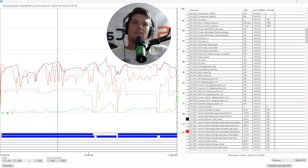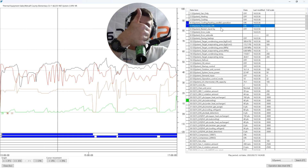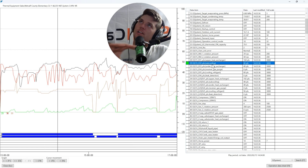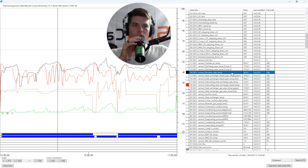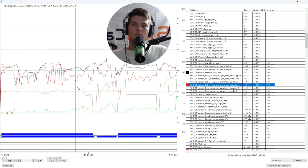What does that look like in data? First, make sure your system is in parallel operation — thermostat on, unit running. You also need the subcool valve open; if it's not open it's not doing its job, so there's no point measuring the temperature differential. Plot those data lines. Liquid receiver inlet temp — sensor B74 — reads 96.8°F. Subcooled heat exchanger liquid temp reads 77°F.